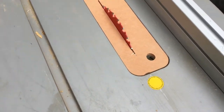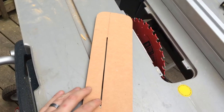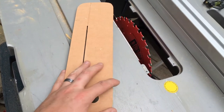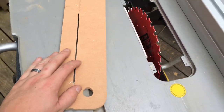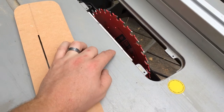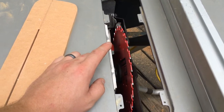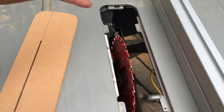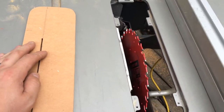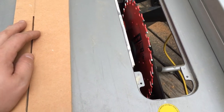I'm going to be using a couple different pieces of machinery today. This one, the table saw with the zero clearance insert plate. If you don't know how to make one of these, I've got a video up that shows how to do that, because that will be real helpful with making this stuff since they're small pieces and you don't want any tear out. I'll be using a Freud thin kerf glue line rip blade. It's got alternating teeth — one flat and then the next one is a double bevel cut and then another flat, and they just keep alternating. It's really good at ripping through stock that's up to an inch thick, which we're going to be less than that with quarter rounded shoe molding — it'll be right close to three quarters of an inch thick.